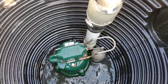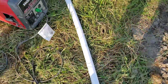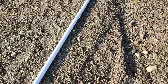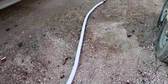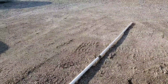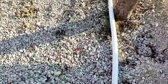An outdoor sump pump system is not like having this happen in your basement or crawl space where you can hear it running. Indoors, you hear the pump running continuously and you notice it's been running a lot. You go check and find something wrong with the check valve. But outdoors, you're never going to figure that out — you're not standing next to your outdoor sump pump system. With a check valve, once it fails on a 100-foot discharge line, it takes out the sump pump. That's how it works.